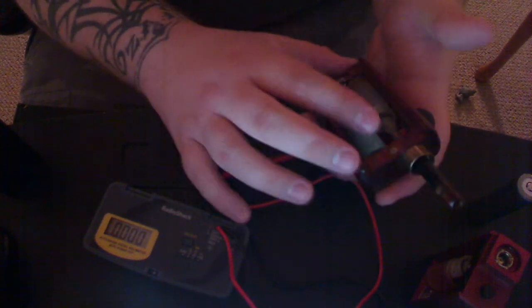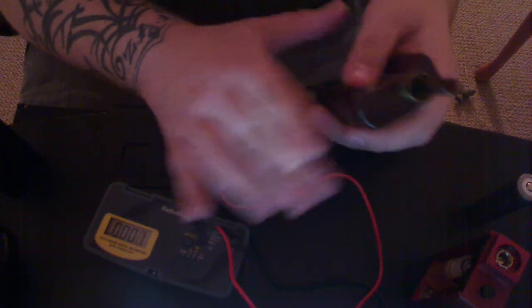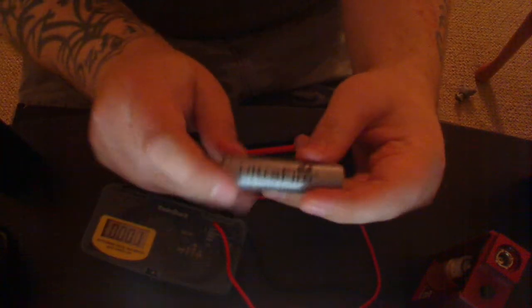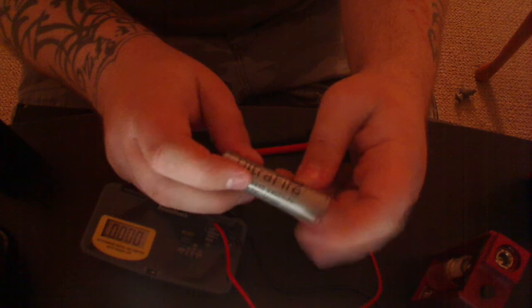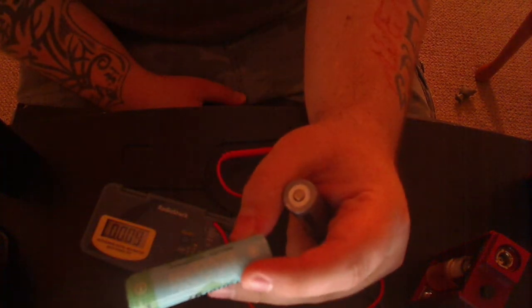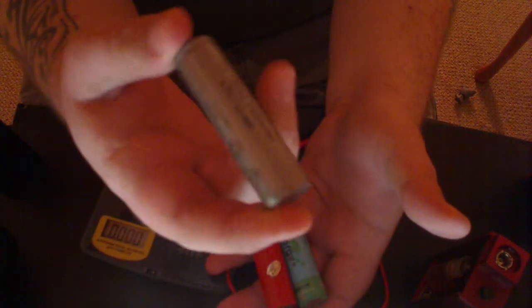Same atomizers, all same setup — except each battery was different. Prior to doing this, they were fully charged or damn near close, so it shouldn't make a difference. What I find pretty amazing is this Ultrafire went from just over 4 volts, almost 4.1, straight down to 3.5 — not even 3.7. Couldn't even hang there. The Tenergy gave me 3.8 something, and the AW was over 4 volts. Results are pretty conclusive: AW is number one, Tenergy is number two, and the Ultrafire is last.